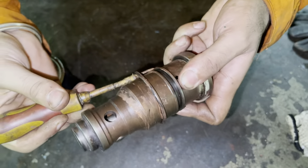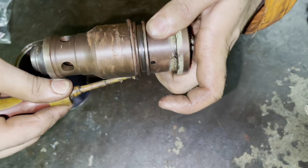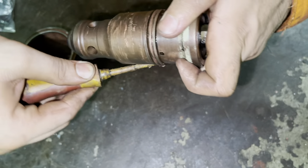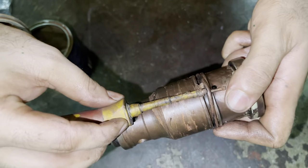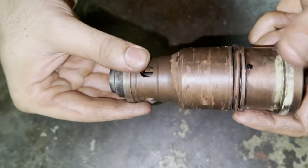Use a small screwdriver, or if not, use a welding rod to rotate it across the circumference of the starting air valve. Rotate it across the circumference. Ensure you do not elongate, cut, or twist it, and in the end take out the screwdriver smoothly.